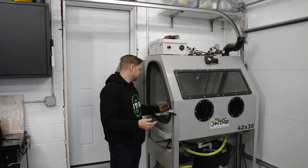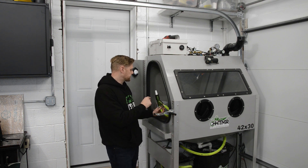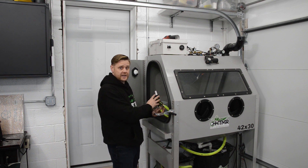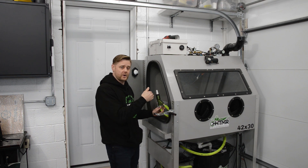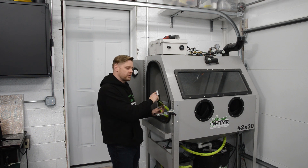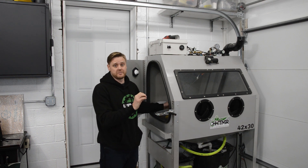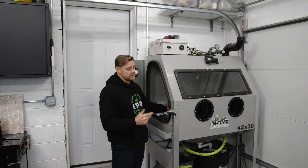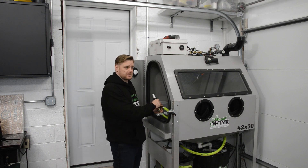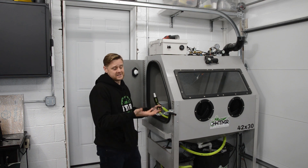You're probably wondering why not just use a 3D printed gun — you can, but mine has broken several times. There are guys selling 3D printed guns for like $80, which I think is crazy because they break. With a 3D printed nozzle, you can't run aluminum oxide — I've tried and 50 thousandths of diameter goes in a matter of minutes. Aluminum oxide will trash it in a heartbeat. Some applications 3D printed parts last fine; in other applications, they may only last a few minutes.